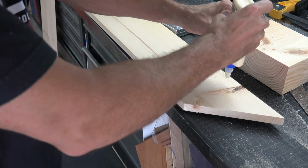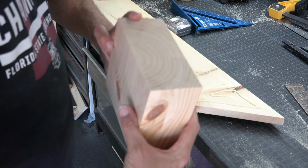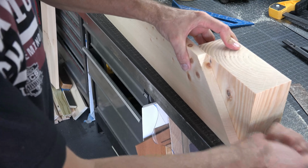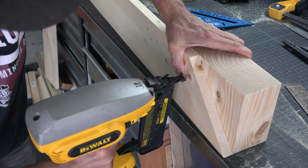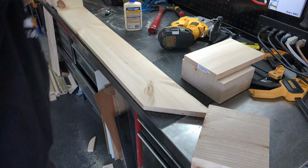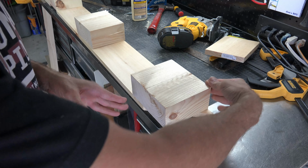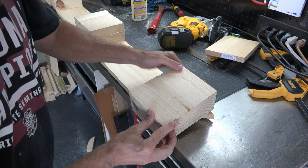While you're at it, you can add the end pieces. Take your block to the very end and align with the edge of the board. Then repeat applying the glue and nailing it down. Do this to both ends. Remember, the pointy end of the board is the outside, so take a quick glance at the face of the block and find out which one is the prettiest and make it face outward. Don't put end blocks on all your boards, just the head and the footboards. Remember, they share ends with the sides, so make sure if you're using them to get the distance to the next block that you have it in the correct orientation.